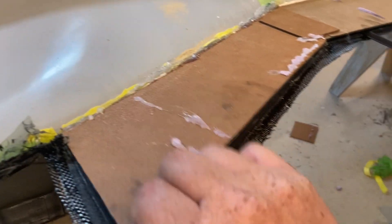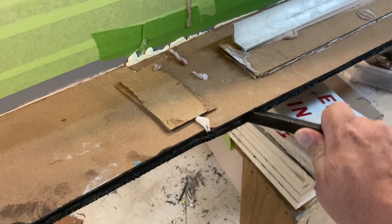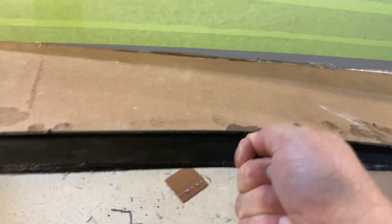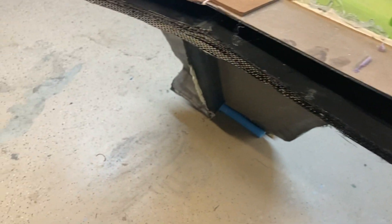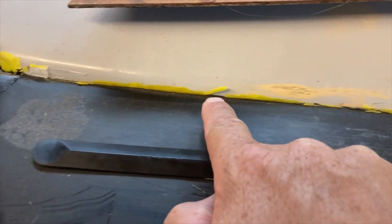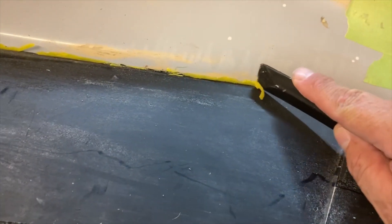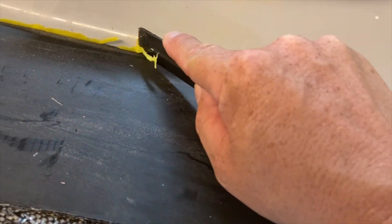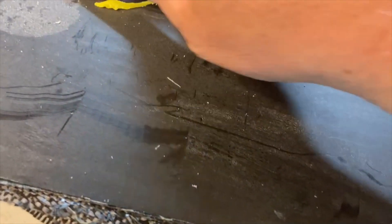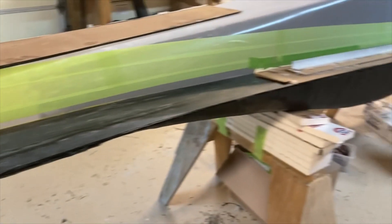I've started removing the splitter plates on the bottom side here. It's loose so I just got a little plastic wedge underneath and I wanted to show you how easy these actually come off — I'm just running it down the sides and it's popping off quite nicely. This yellow stuff in here is the filleting wax. From the last episode I used a little bit of filleting wax and shoved it down in there to make sure the gap was nice and tight. It's still soft so I can just take this little tool and it comes right off. Just a little cleanup work, but that's a nice clean line.